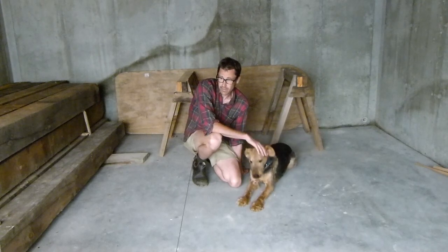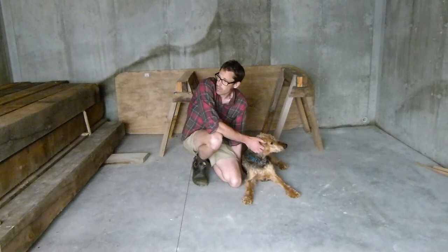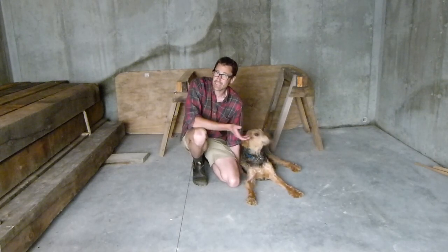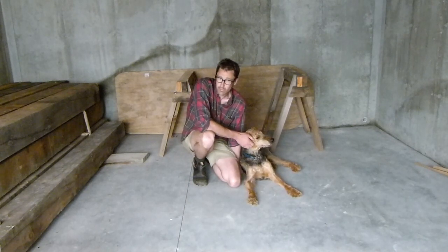Welcome back to A House From Trees and welcome to season two. Got the plans done — thank you Matt Burke of Riverside Survey. I'm going to start measuring, squaring up the ends of these beams, these posts and beams, and drawing out my notches — basically a cut plan. This year's plan, before the snow flies, is to get the frame up. Ideally I'd get the roof on and get the driveway done, so we've got a little more excavation time. I'm going to have to put a frost wall in out here. Stay tuned, there will be more coming.